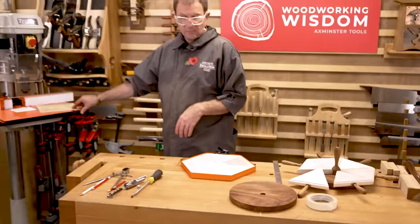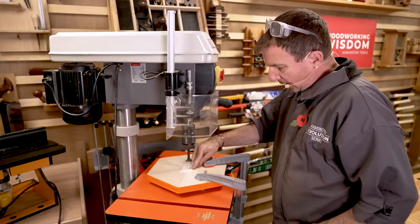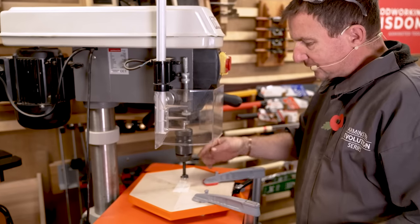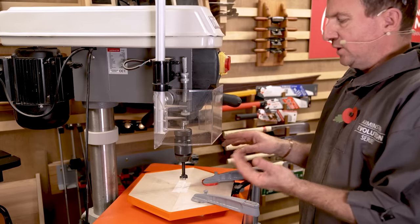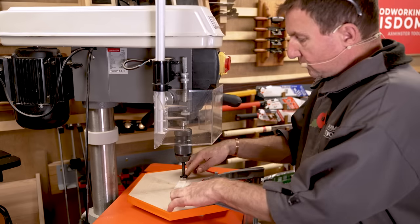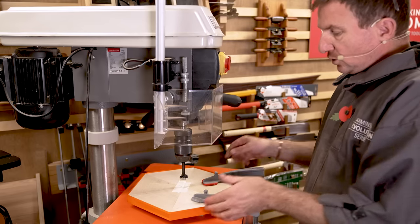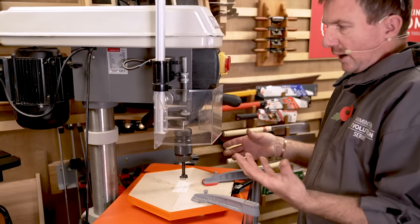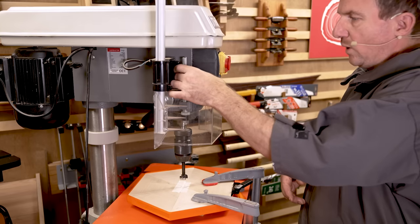So we go to the drill, I think, and then we set this up. Okay, so we come back to the pillar drill, 25mm drill. We've got our masking tape. We can use the pinpoint accuracy of that to line this up with the tip of the drill. But remember, there's no center point in there at the moment, so it's difficult to see. So line that up, got our lines, clamped it down, got in position. The ratchet strap's pulling everything in, which is great. I've checked the depth so we can drill all the way through in one go.